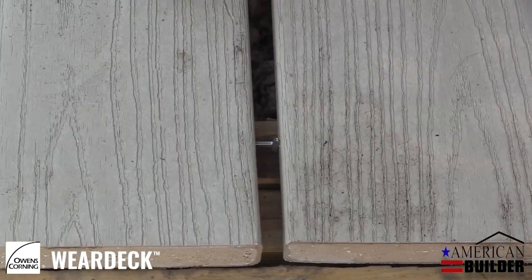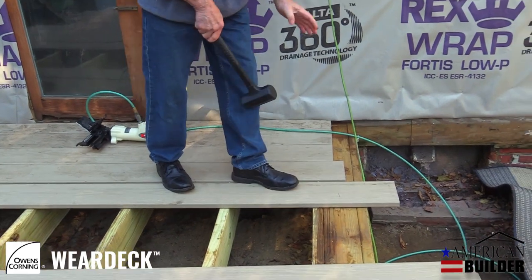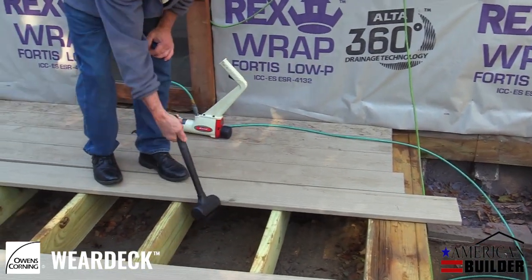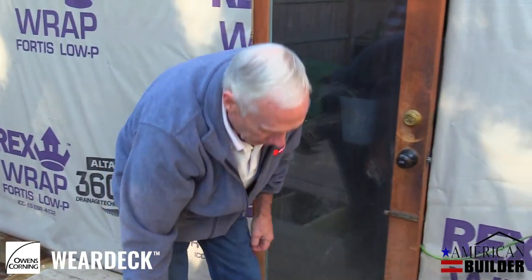The spacing it does by itself, the strength of the fastener — that's the reason you're here, putting down a new material. So Glenn, how's this product taking the HitFast system? Terrific. You can tell that it's a very strong board, very dense, but HitFast goes through no problem. So we're going to put a picture frame board around to cover the end cuts. Because we're working with a very fast system, we'll let the boards run long, come back with a straight edge and cut, then put our picture frame on. So we're going to drive on the next board, just slide it up. You have to use your weight to hold the board down to the joist, drive into a couple of points, and then just back up. Keep walking back. As you tap on the board, once it hits the spacer bar, it's automatically gapped.